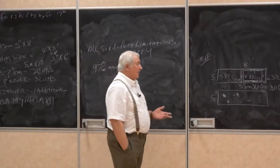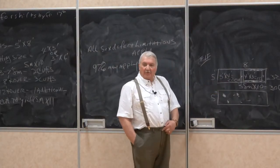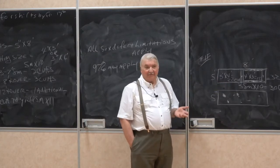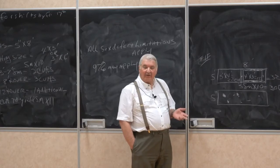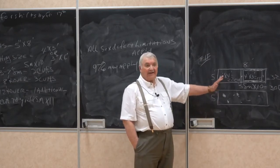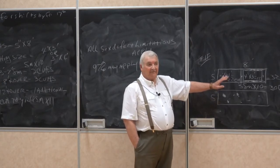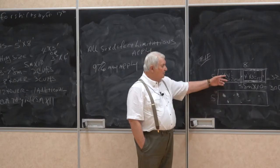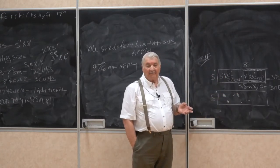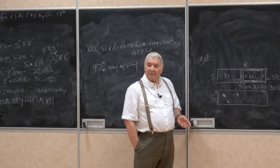Different. That's a good word, buddy. Well, I usually tell folks, the best thing to do when you come to a walnut board and wonder which side to measure first, for FAS one face select, measure the FAS side. See if you can make an FAS on the better face. If you can, just turn it over and see if the reverse side of your cuttings are sound. If they are, you're good to go. You got an FAS one face walnut.